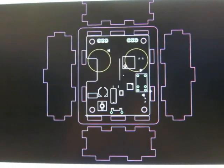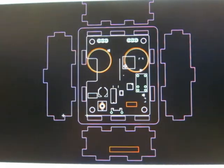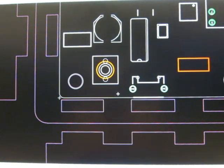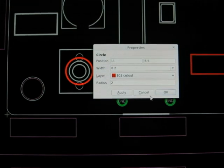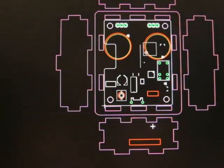Once the outlines are finalized, you can continue to create custom cutouts for buttons and connectors. Because the cutouts are embedded in the PCB design now, it's pretty easy to align the cutout with their designated components to make sure that their positions and sizes are all correct. I generally create cutouts on a different layer in Eagle — for example, I can call it the cutout layer. This way, if I need to rerun the script and regenerate the acrylic layer, the custom cutouts will be preserved.